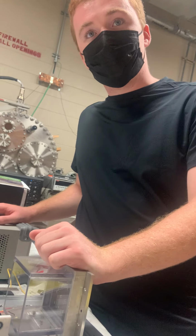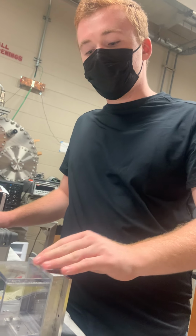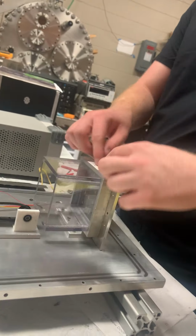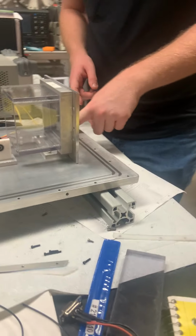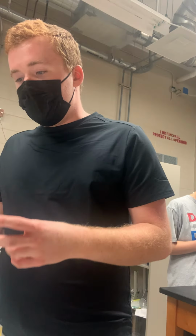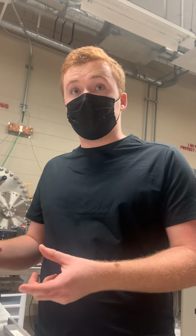So you design it using a software, and then does that software go to the machine shop? So in the software, I design individual parts. Let's say this little dish might be a single part, right? And then this metal plate that screws on here might be another part, and this bracket's another part. And then in the software, I'm able to assemble them all and add screws. And then I break it down part by part. I make those parts into drawings which have a standardized format.